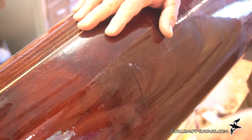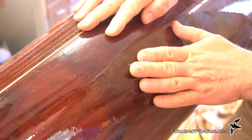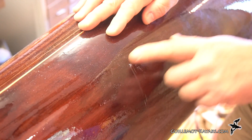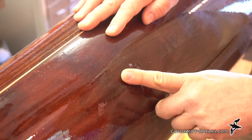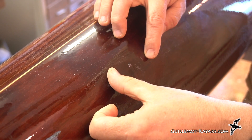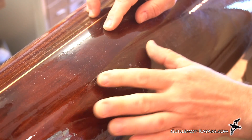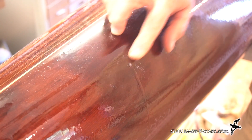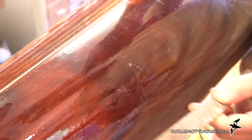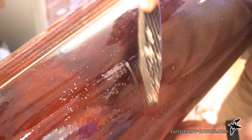Before I get going, I'm just going to take care of some of the drips. I did mask this off down here to try and keep drips off the deck of the boat, but every once in a while a drip gets across and we're left with a spot like this. If I tried to sand this, what would end up happening is I'd slowly work away at the top but end up with a halo around it where I sand into the surface. Just sandpaper on a fairly soft pad — that's what ends up happening.